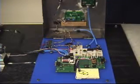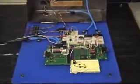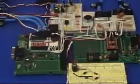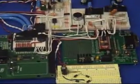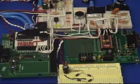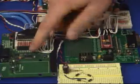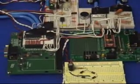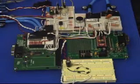So instead of using the main PIC microcontroller such as the 88 or the 84 that's used in the lab, I decided to go with just the basic stamp. This is a BS2E, and that's just a BS2. They're the main microcontrollers provided by Parallax. This one's already integrated into the board, and it has a programming port right on it, so I can have a debug window and serial communication to my computer as I'm using it, so it's a lot easier to debug the program.